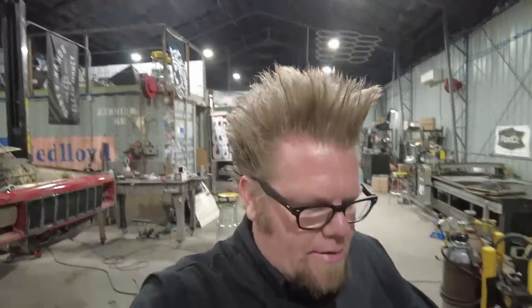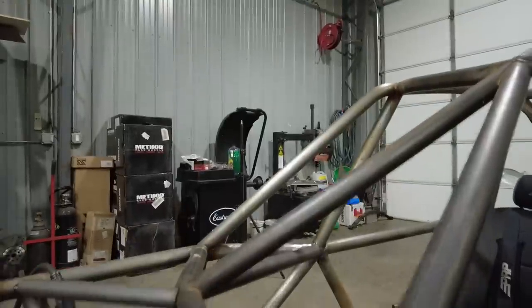Yeah, I could have notched it, ground it, and then test fit it a bunch of times, but you're always kind of guessing, especially when you've got tubes coming on multiple planes like that. So I have one that's basically flat, and then I have one coming at a high pitch like this. That just gives me an idea of where to start. What I'll do is sneak up on that line. I won't grind right to the line.